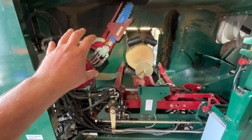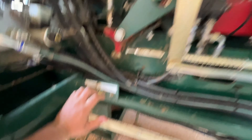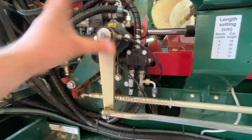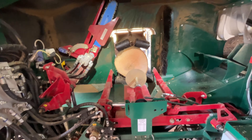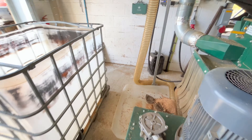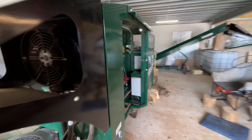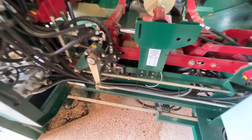This is the speed controller for the bar - I'll explain how that works a bit later. We've got a grease bank here that does pretty much everything on this changeover mechanism, so that's easy to grease. Then we've only got about eight to ten grease nipples to do individually around the machine itself. You get these two big pins that run through the whole machine - grease nipple this end, grease nipple that end. You've got bearings on the debris belt, bearings on the infeed belt, a bearing here and a bearing here - that's it. Very easy to grease and maintain.